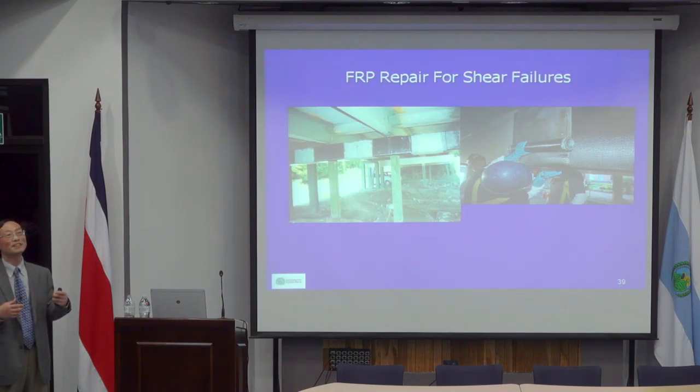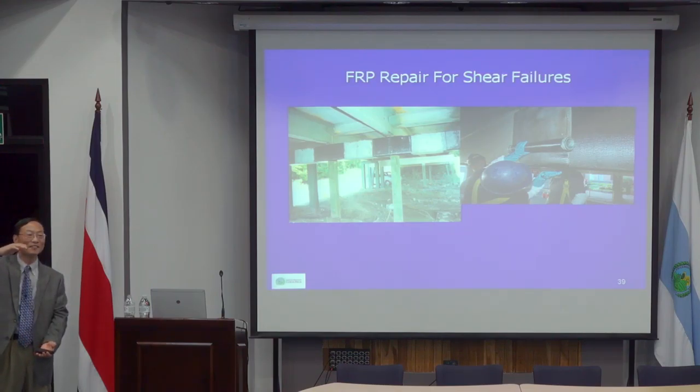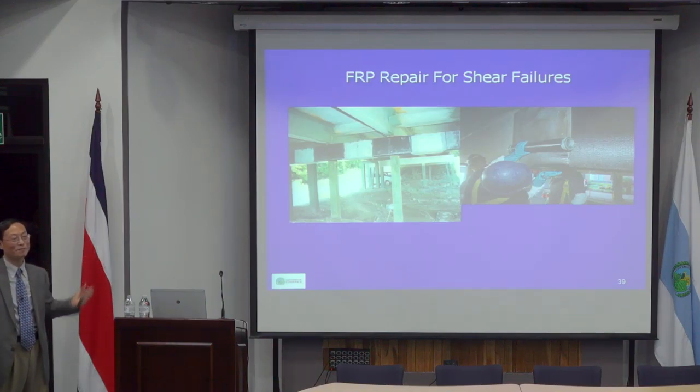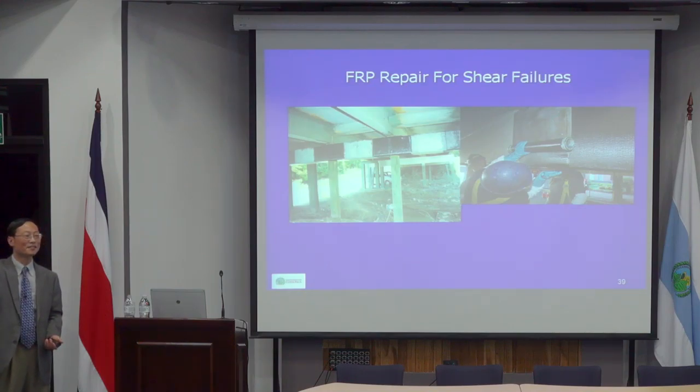I found that when he designed the structure, he wanted to minimize the clearance, minimize the structure height, so the beam is very, very shallow, like a reverse T shape. They have a double T sitting on a reverse T flange, and that T is cracked. I did some calculation. I found it was slightly underdesigned, but normally it would be fine.